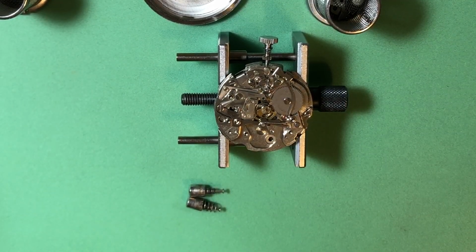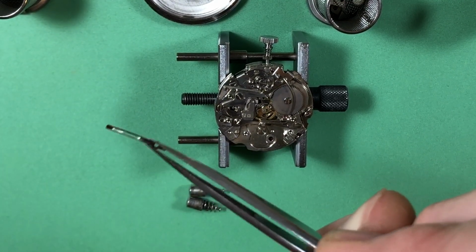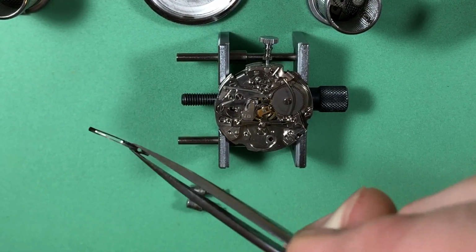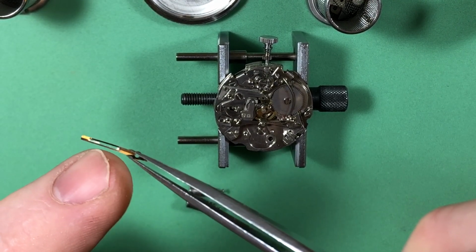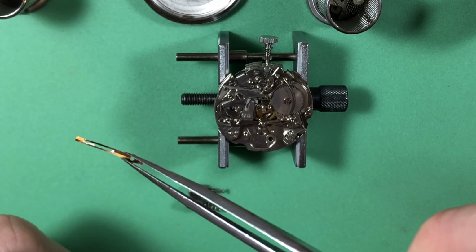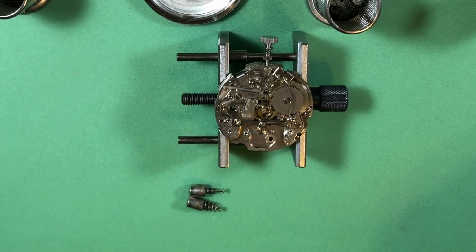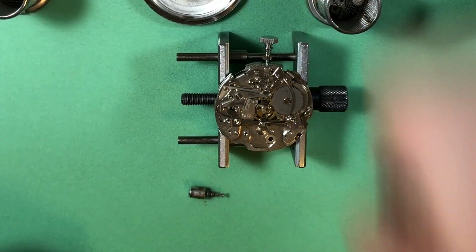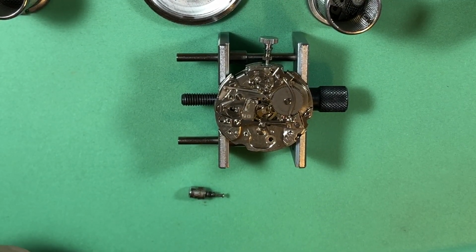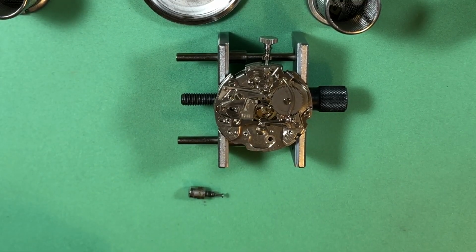By the way, this minute hand is seriously jacked up. It's pushed sideways. It's tweaked sideways. And you can see it's rippled right there on the other side. So the whole thing got moved over. Believe me, I've tried straightening that kind of thing, and you can always see it. You can make it look better, but you look at the reflection, and you always see it. It's always there. For a watch this nice, we got to do the right thing.